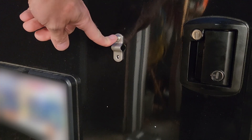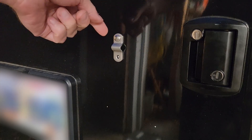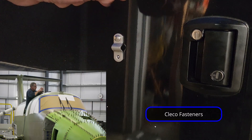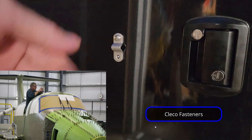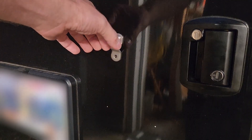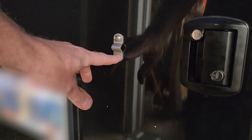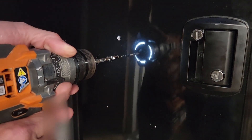So what you do is you drill a hole and insert a fastener. If you work with aluminum you'll know that you basically use clecos to act like a temporary fastener as you drill holes, so that tolerances don't stack up and you can actually get a fastener or rivet in the hole because it's perfect. What I did was get this vertical as best I could, stuck the drill bit in, got a mark, then I can take this out and finish drilling this hole.